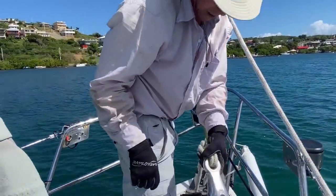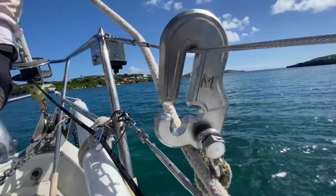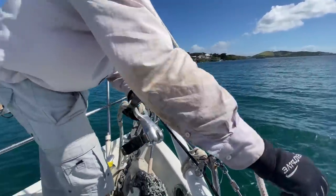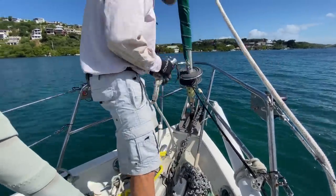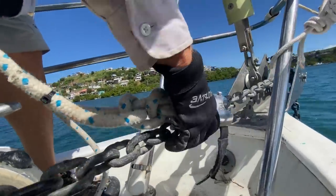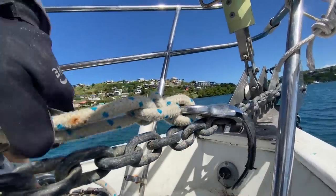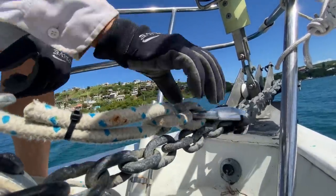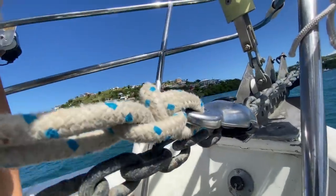So Mantus went from that chain hook, this is M1, to M2. Model, just M? I know, it says M for Mantus right here, but it was model number one. Okay. And this is just a claw, boom. Right, so this one is a lot more intuitive. You slip it over a chain link and it grabs a chain link like that. And then you take this plastic keeper, or this rubber keeper, just like that. And now it can't pop off when it goes slack.